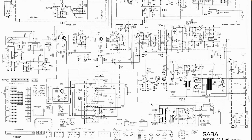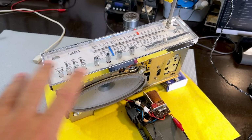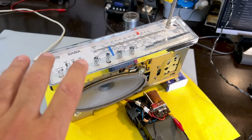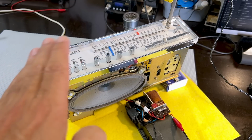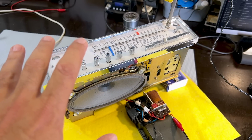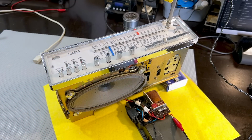All right, I'm glad with progress so far. I'm glad I sorted that out. In this restoration business or hobby, sometimes we're good and sometimes we're lucky. And in this case, I think I've been extremely lucky. I started doing some checking of the capacitors. In fact, I started changing them, the big ones, straight away. And I noticed that the big filter caps that were in the circuit really needed work. They needed replacing because it had to do with the full 13 volts, whatever it was that they'd applied to it. So those definitely needed changing.